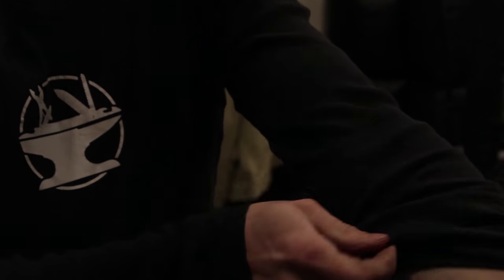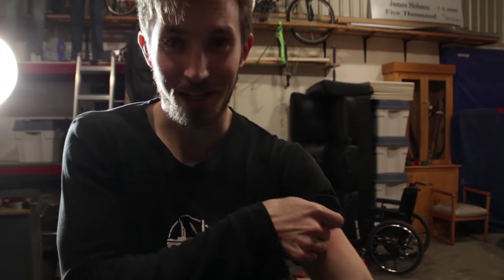Just a quick note about safety: you should always be welding with a long-sleeved shirt on, preferably a leather apron with sleeves, because if you don't, you can actually get sunburns from welding, and that's actually a UV burn, so that won't even tan. That's just bad news for my skin. Won't happen again. I'm going to be wearing long-sleeved shirts from now on. I do have a pair of leather sleeves, I just don't know where I put them.